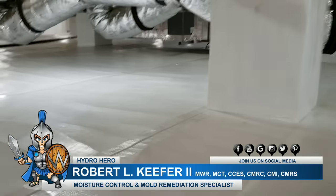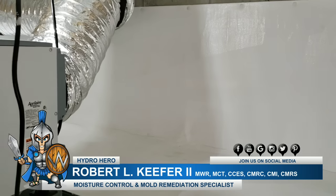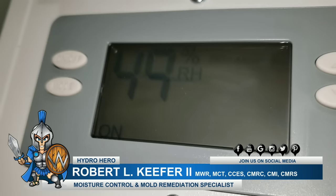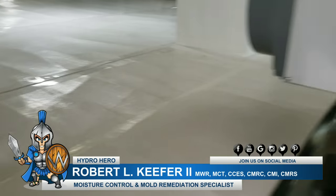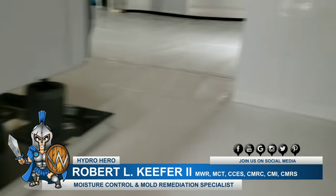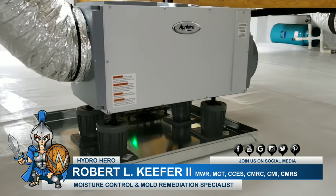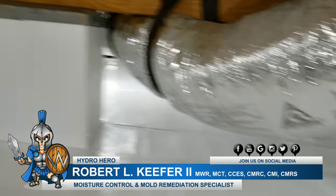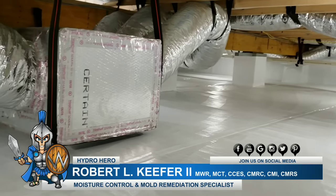Let's see what the relative humidity is — we shoot for 45 percent. This crawl space was up in the mid to high 60s and now it is at 49 percent right now. It'll be at 45 percent here relatively fast and then it'll maintain that from here on out. Why do we keep it at 45 percent? Because outside of microbial growth or fungi growing on the wood framing, dust mites like to live at 50 percent relative humidity and higher. So we keep out dust mites too. The stack effect will bring this dry air up through the house and allow the indoor air quality to be improved even more and stop more asthma irritants.